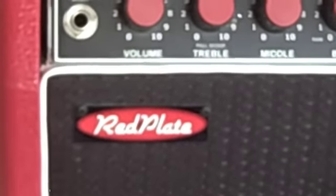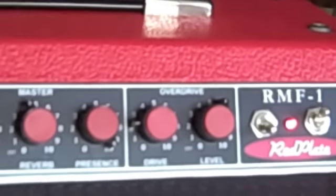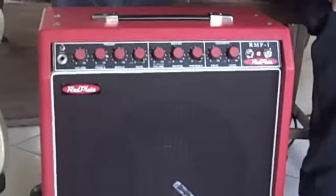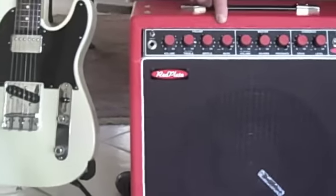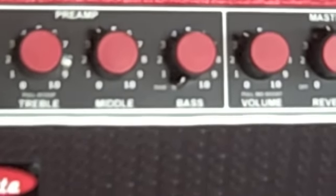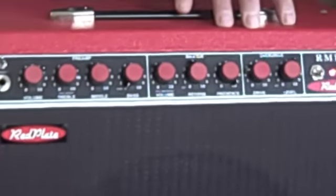Another cool feature of the amp is the overdrive circuit. This is all one channel, so the overdrive circuit does integrate with that one channel. It can go from just a screaming overdrive — but still with clarity — to just enough overdrive to give it a real sweet, singing kind of tone. Also, if you look at the bass control, just below it is the word 'raw.' By clicking it — you can hear it click — you've actually turned off the tone control, bypassing what's known as the tone stack, going from the preamp volume control right through to the outputs. That tonal quality will also affect the overdrive circuit, meaning how you have the preamp set is how the overdrive is going to react.